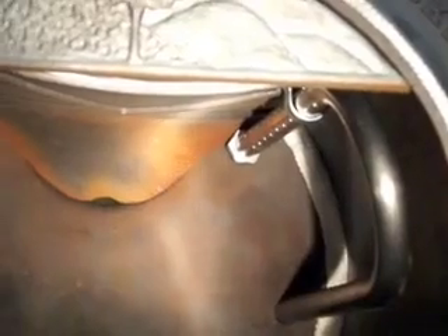Now we'll take a look inside the stove. There is a cast iron baffle which is used in all of the 18 inch barrels. The 1 inch steel U-tubes with a network of holes across the top, which provide the 1000 degree plus preheated air for secondary combustion. This doesn't have bricks in it currently, but the bottom of it from front to back will be lined with splits, they're called.